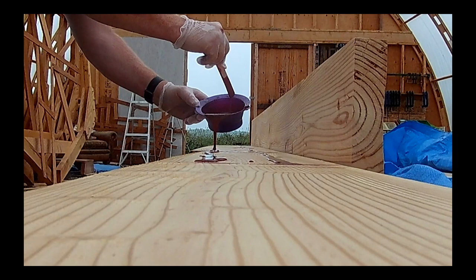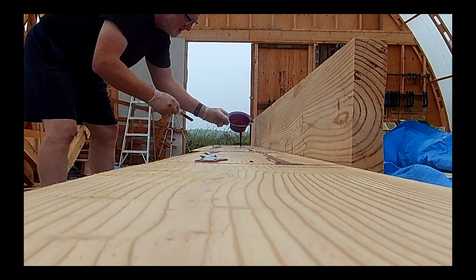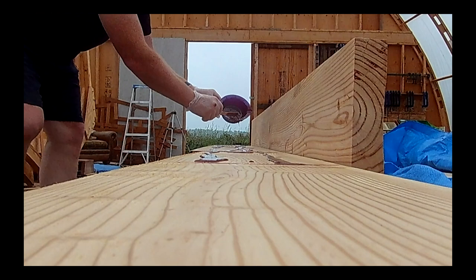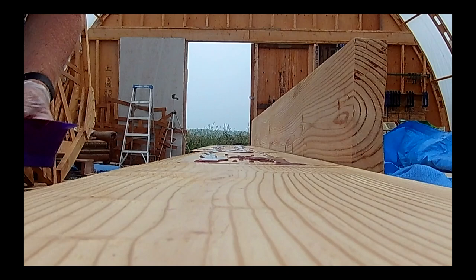Once thoroughly mixed, the adhesive is poured onto the area of coverage and smoothed out to cover one of the surfaces being bonded. I would typically pour out about three quarters of the mixture, keeping some in reserve to apply to the remaining bare or thin spots.